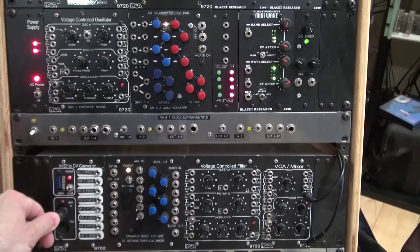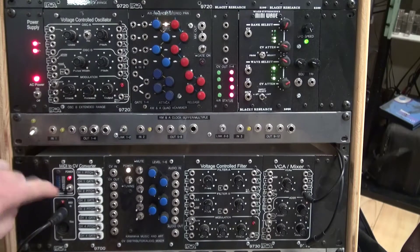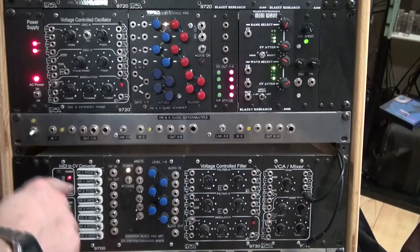First thing: MIDI in. If you're going to be using a MIDI setup, put your MIDI cable in there from whatever you're using — keyboard, controller. For the basic setup, all the DIP switches are pointing that way, they're all flipped to the left, so it's in mode 1, channel 1. They have this strange thing where, in order to have the VCOs in the right pitch range, you turn the power off, hold down low C on your controller, turn the power back on, and then release that bottom C note. You'll see the MIDI activity light blink, which shows MIDI is coming in and sets the pitch range of the converter.